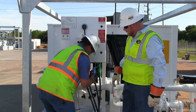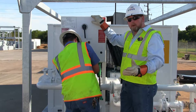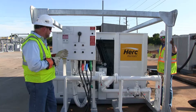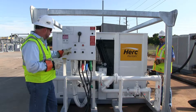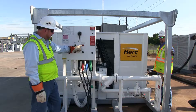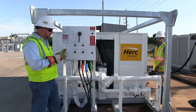Now we've got all three legs hooked up. We're going to energize the unit off the main power and determine whether or not our phase is correct. Our power light came on and our phase incorrect light is on. This indicates that two of our primary phases are backwards.